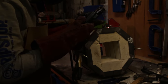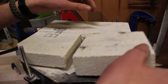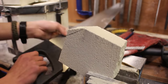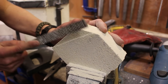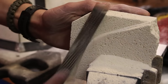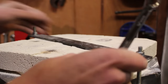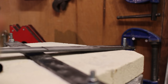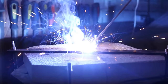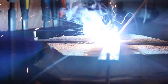I repeated the flat bar and drilling process to create two more clamps, giving four clamps pulling everything together. Despite half the brick being broken I still used them since they were expensive. I used a wood saw to chop off protruding corners and a wood rasp to file away material so the base would sit flush. Once everything was sitting flat I put on the flat bar attaching to two of the four legs and tightened up the nuts. I then welded a cross-pattern support in the middle to hold the fractured bricks and make the base strong.